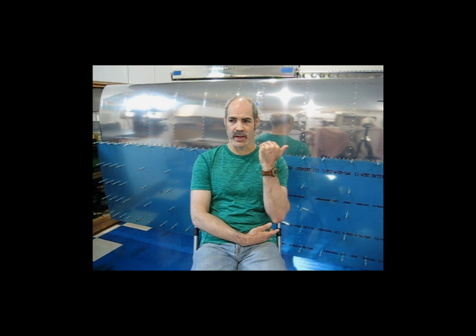And I had added more sealant to the rivet, and I put the rivet in and taped it and back riveted it, and they're a little proud. And I think it's just because of all the sealant that was jammed in underneath the head, it just didn't let it sit down far enough. So I am not adding additional sealant to these.